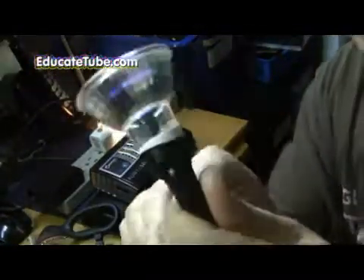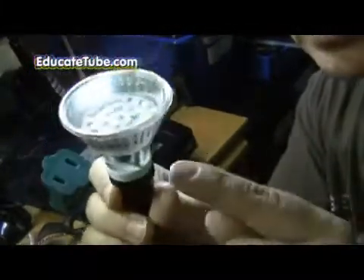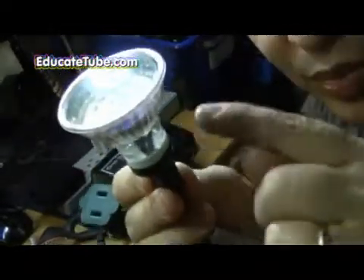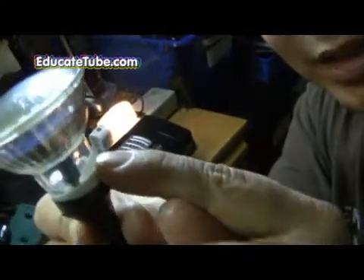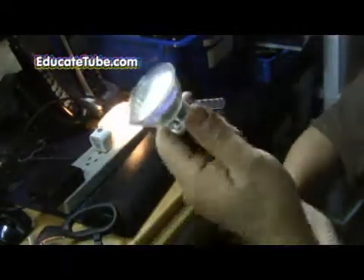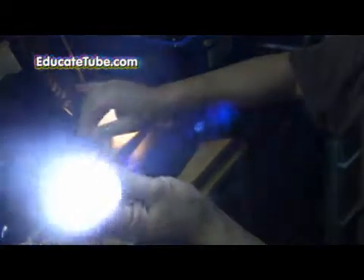It's pretty tight now. It looks like a light socket, but it has a plug at the end. The reason why this works is because the electronics component that converts AC to DC is already built into this LED light, so you don't have to worry about it. I can see some capacitors in there — I'm sure there are other circuits as well. Let's just test it out. If you plug in directly to the AC adapter, just do it temporarily for a couple of seconds — there we go, it works very well. And it's cool to touch, no problem.